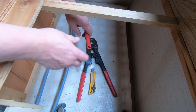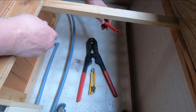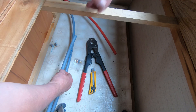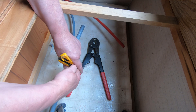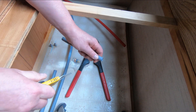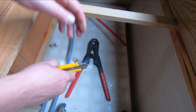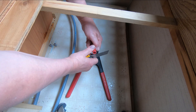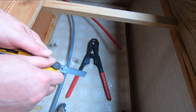Here's the other end of that pipe. They didn't even use a 90 over here — I guess I could have used a 90 to bring it in nice and neat, but it just sits in this compartment, it's fine. I'm going to bring this around and cut this poly B off here — that's about right. There is a proper squeeze cutter for this pipe but I couldn't find it this morning. I'll just tidy up the end of the pipe a little bit — nice and straight.